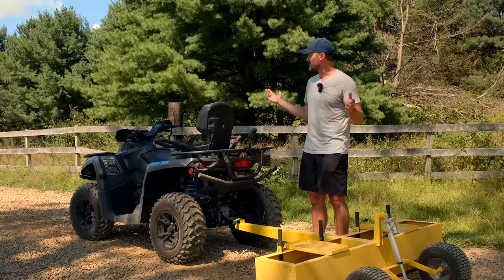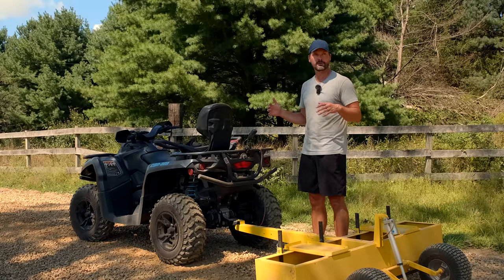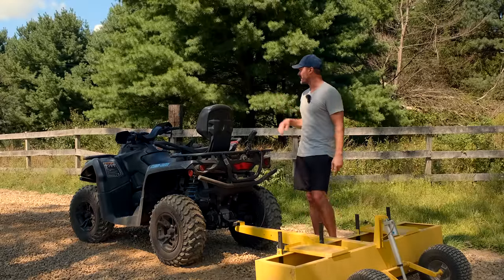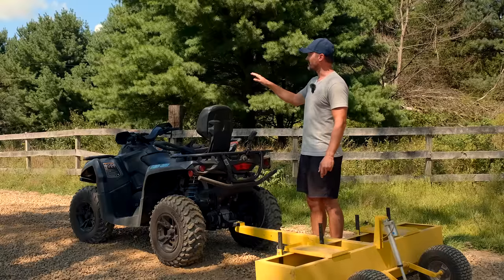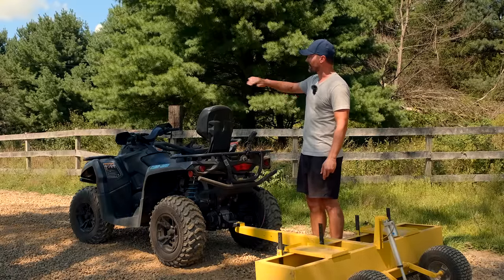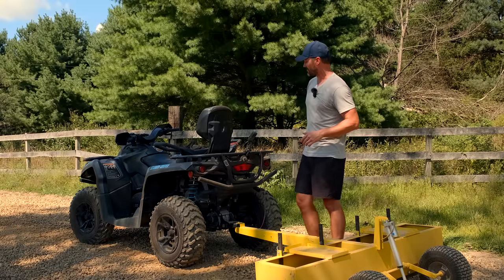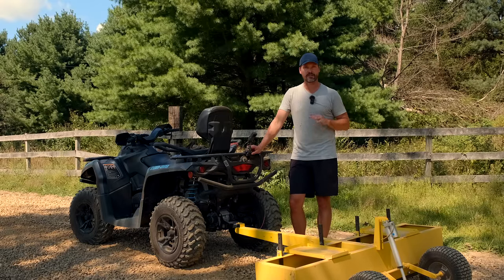500 foot driveway. We now have 200 yards, 300 tons of 21AA gravel on here, road fabric underneath. Got another driveway expansion coming up, going back to the barn as well. And I think I am probably going to have two or three more loads dropped off in the steep area, so I have extra material to work with and build out that steep slope, just to make it safer to traverse. I can see in the wintertime that getting kind of dicey, slipping and sliding, so I want to level that out as best I can.